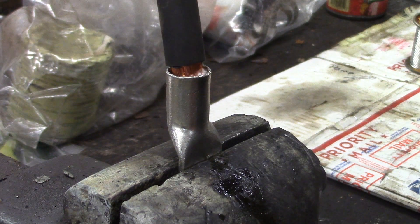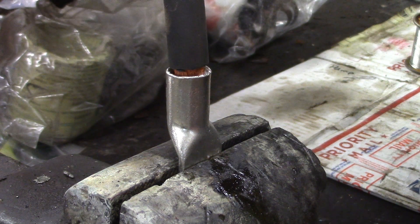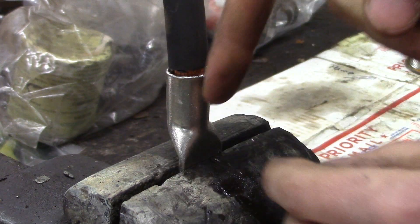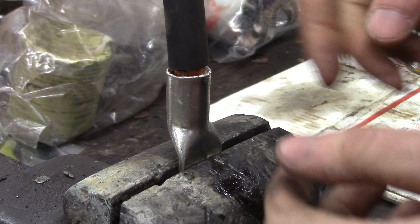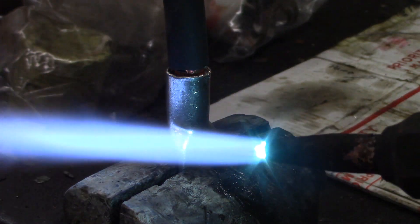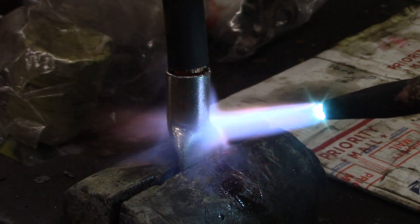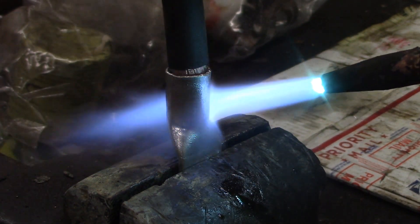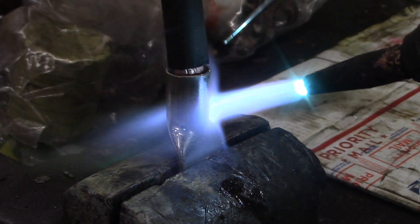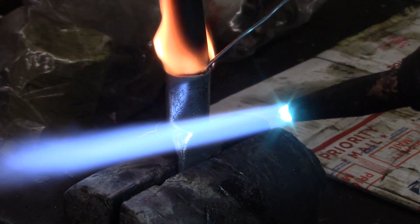Block up the wire. As it lays on the bench it can flop one way or the other, so play around with it a little bit and see what works best to hold the wire in the most convenient straight position. You don't want the wire coming off at an angle unless that's where the cable is going. I hold the torch fairly far away so I don't put in too much heat, and I aim kind of down low so I don't cook the insulation. You'll hear the flux sizzle and burn away a little bit, and once it stops sizzling it's time to start feeding solder.